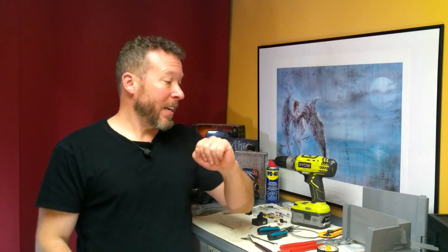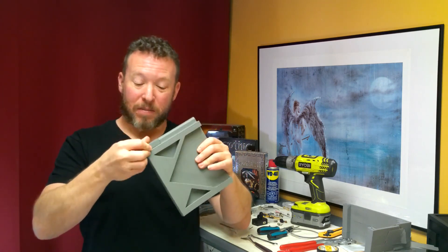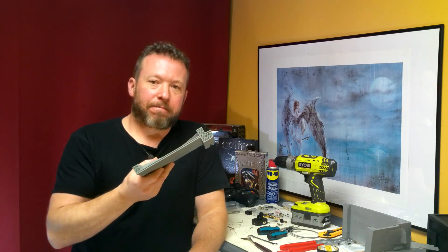That's not Sovol's fault, and that's also not that big a deal. On the other hand, I can report that my door design with the 3D printed hinges — even though squeaky — would actually work. The print would have finished. And that's where the issue started. I said last time that the PETG filament tries to stay in the shape it was in for a long time and can get caught on the filament runout sensor.